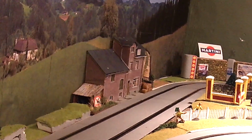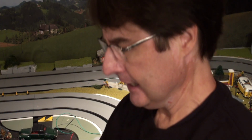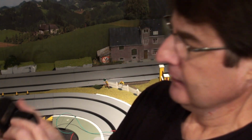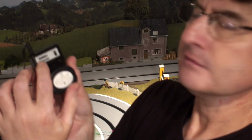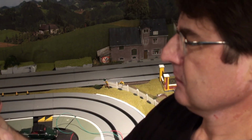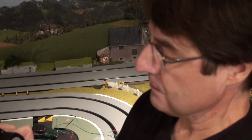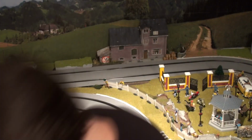Now, all right, so let's test our lights. I have an adapter here. This is kind of a cool adapter. I use this for testing different things, lights and so forth. The really neat thing about this is that it actually has an adjustable output for direct current from 3 volts all the way to 12 volts. So let's set this to 12 and we'll plug it in.